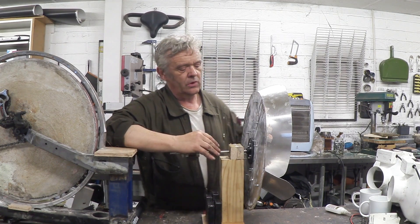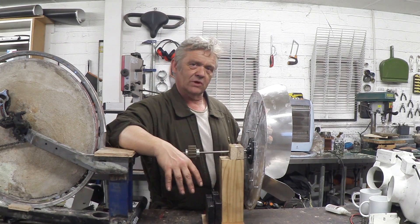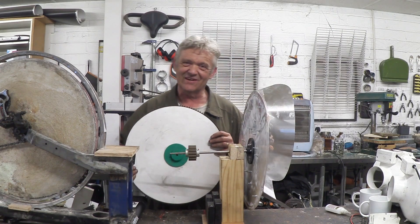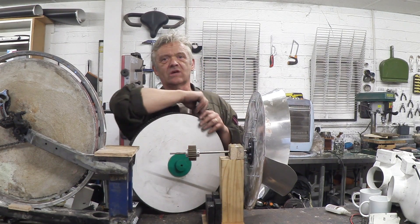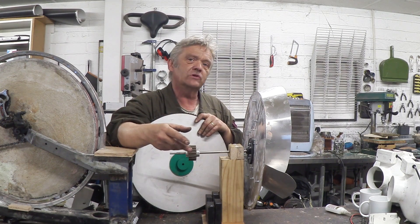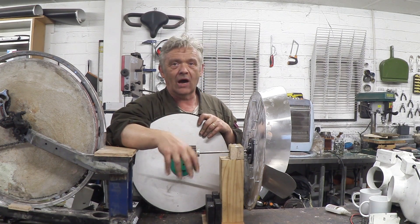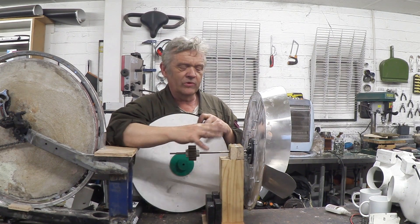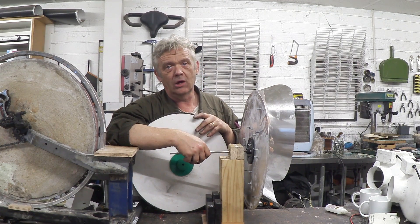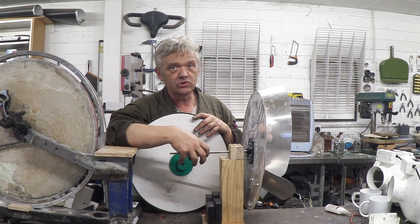This works particularly well for the Rows turbine, because it creates a blank space behind it due to the big shield, so we can put anything we like there. That's not so efficient for a turbine with fan blades, because sticking a massive cog in the back creates a lot of resistance. Equally we could do the same thing with a VAWT, since they're upright and all the mechanisms are down below. So for the Rows and VAWT you can use a much wider range of motors. If you want to do it on a fan turbine, you'll need some arrangement to take the power down — ropes and pulleys could do that. The main issue is matching your motor and its connection to the turbine so the input matches what the motor needs to be a generator.